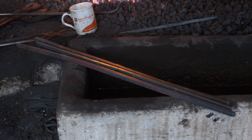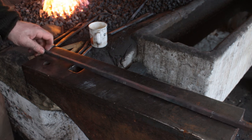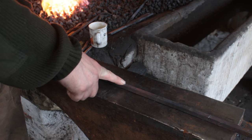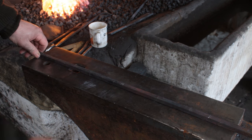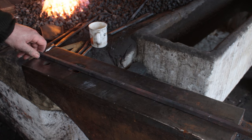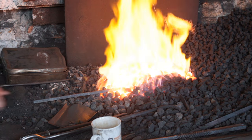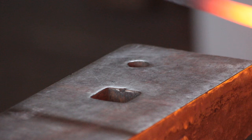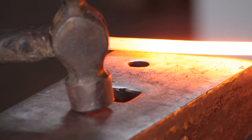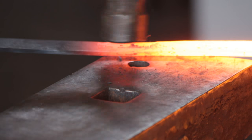So here are our three bars. Each of these bars I will mark off in the centre and then two and a half inches either side of that centre mark. I will mark off a four and a quarter inch section and that is where we will put the twist. So get some heat in it - that's wrought iron so work it as hot as you dare. To start off with we are doing a rope twist, so you want to start off by rounding off the corners in between the centre dots marking off that four and a quarter inch section.